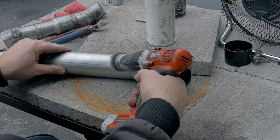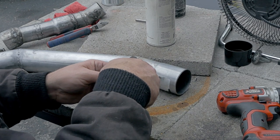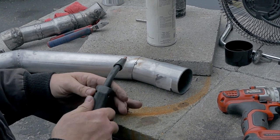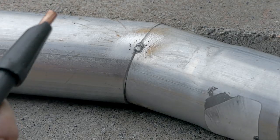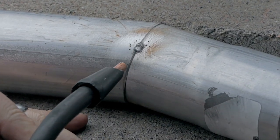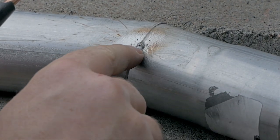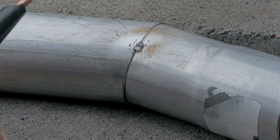That's why you really got to keep this clean. Another thing — you don't want your hands just floating up here while trying to go over the same spot. You're never going to get a controlled angle or controlled attack at your welding area. See right here, my hand is down securing it so I have a lot of control and can do very slow movements right across. Also, a lot of you are going to want to hit it and go down really far, but you can't do that with this kind of welder — it'll get too hot and you'll punch a hole straight through. You've got to do short attacks one at a time and clean it off each time.